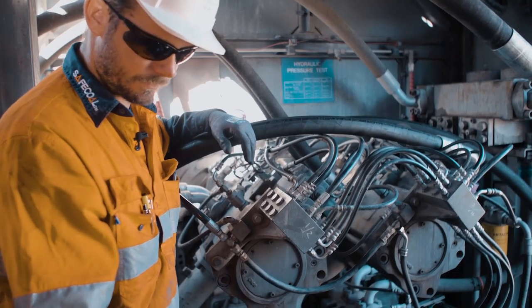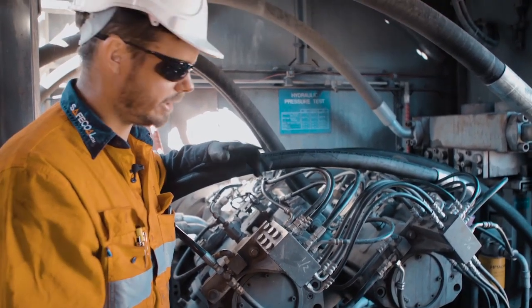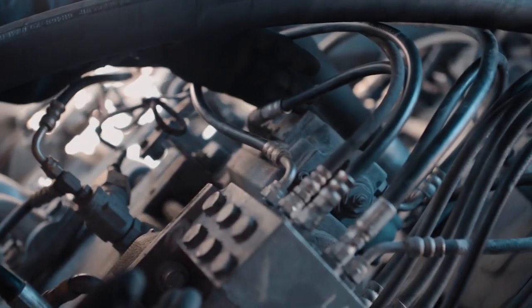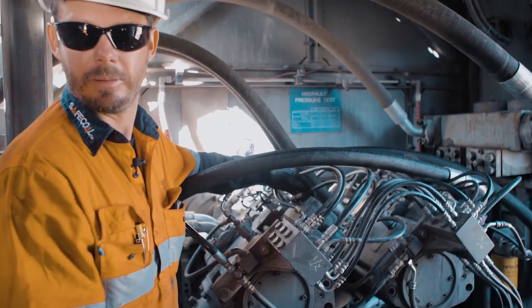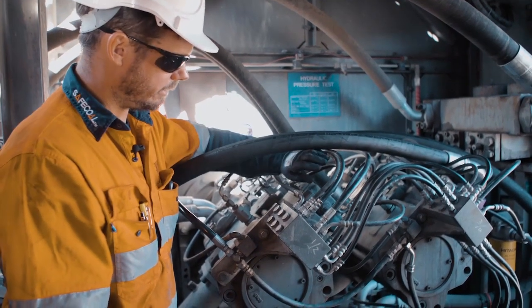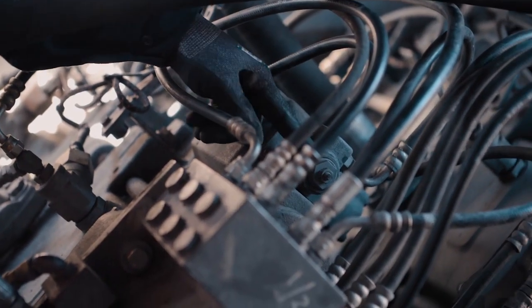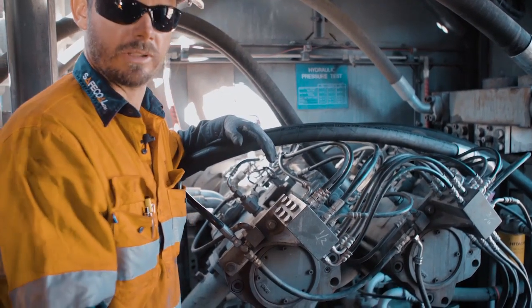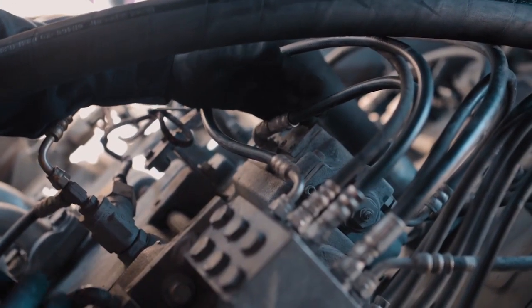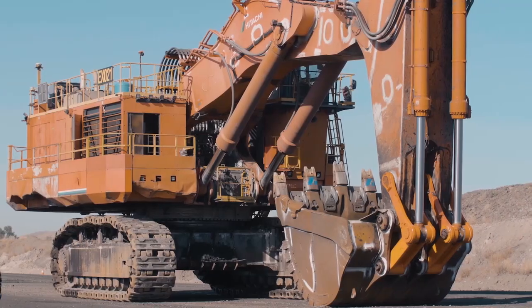After you've done your initial flow test to see where your pumps are, you come up to your regulators, unload the pump, take all the pressure off the flow meter, and adjust your regulator to the desired pressure and flow rate. Then you come back down, load the pump up, cycle through the test again, and keep repeating that until you get the desired pressure and flow rates according to the specs.